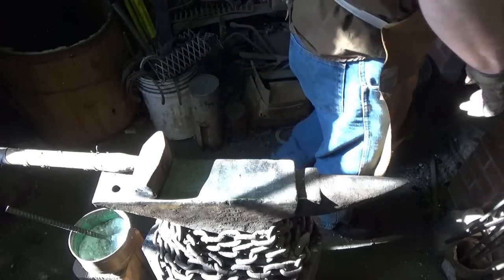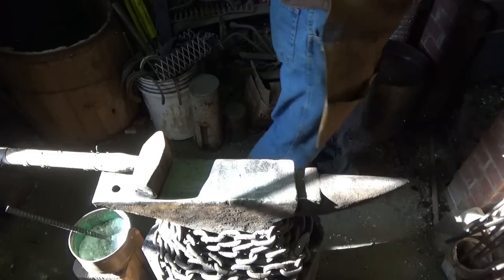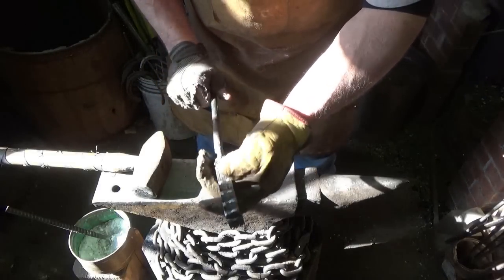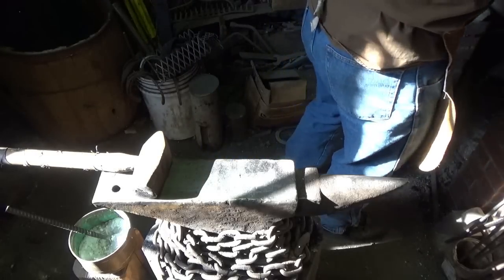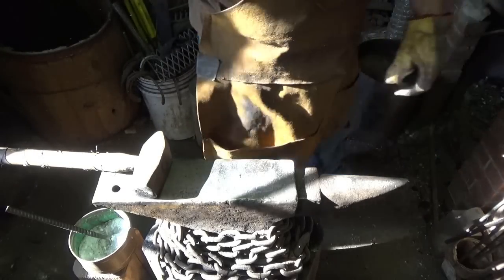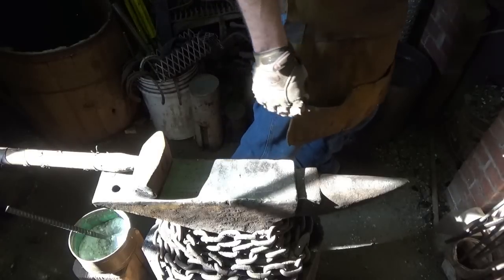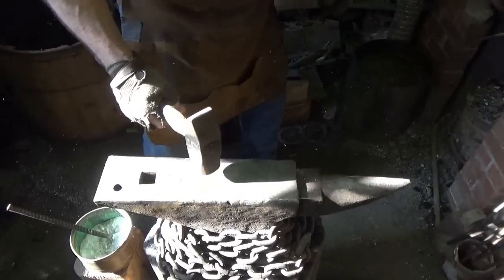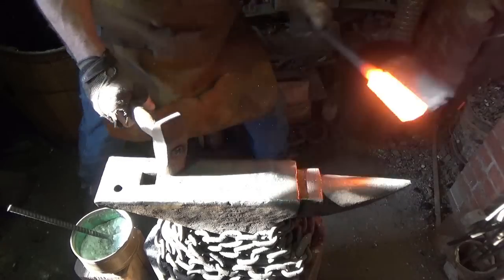And now we'll go in and, again, slowly but surely, I've been heating it on the end. So instead of laying it flat in the forge like this, I'm laying it on the end. Hopefully that heat will dissipate to the center better. And we're just going to slowly bring that up. I can't rush it because that inside mass has to be the right temperature. All right, let's see if we can get down that billet and back. Two hits all the way down and back.